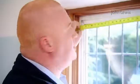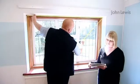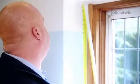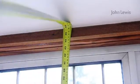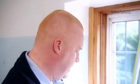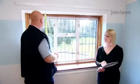Now for roller blind purpose, the brackets at the top is the widest part, so that's where you need to measure from. So on this window it's 1870. Okay. On the drop, you need to measure in 3 places. Right. So far left corner, in the centre, and on the right hand side. Now we know there's a low spot here, so what we'll do is we'll measure that just to be on the safe side, and that is in fact a centimetre smaller than the 2 corners.